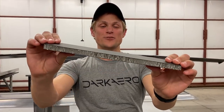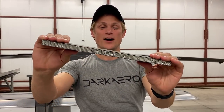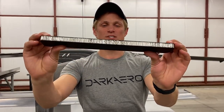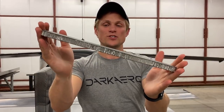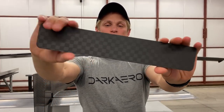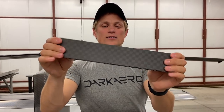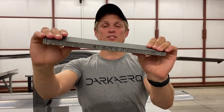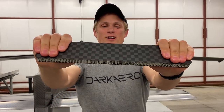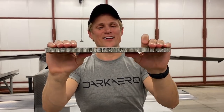What is a honeycomb sandwich panel? Basically it's a composite structure that's made up of a core material that's faced on both sides with skins. In our case we're using a half-inch aluminum honeycomb core and then for the skins we have carbon fiber skins. The objective of putting a core material into this panel is that we're trying to strengthen and stiffen it up. I'm trying to bend this right now and it's not budging.